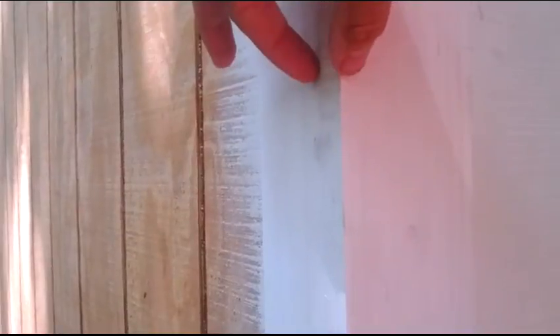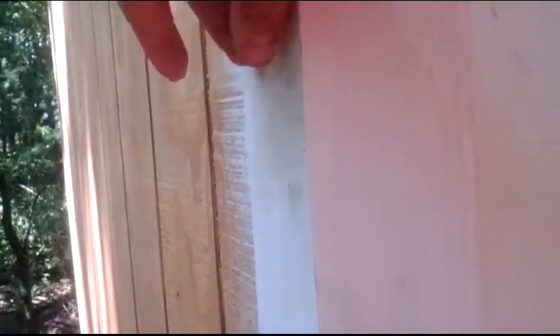What I did with these corner boards is — back in the shop — you can see this joint right there. They're glued, and I used just about every small clamp I had to glue these up. Before I glued them, I ripped one piece so that this combined with this piece plus the thickness of this piece equals the width on the face. Because I absolutely hate it when corner boards are done without ripping one piece, so this piece ends up being, say, five and a half plus three quarter, and this one's only five and a half. Right now they're both five and a half. That's just a peeve of mine — any carpenter who does a corner board without doing that is just lazy. But enough snobbery.